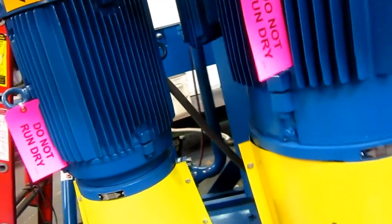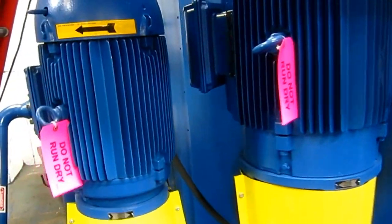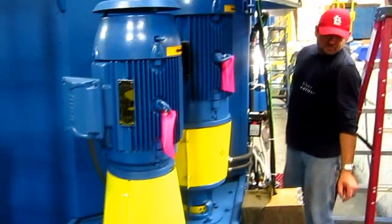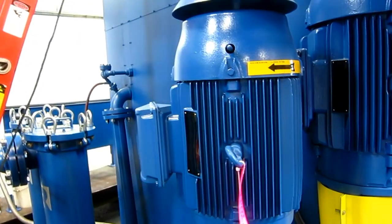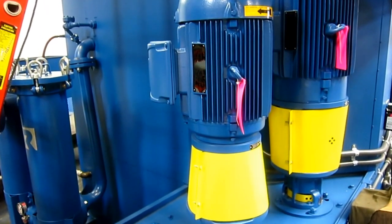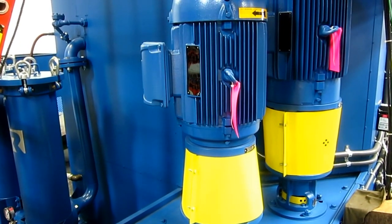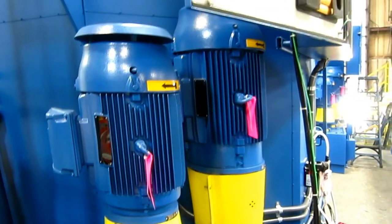There's the duplex pumping system. A small suction pump feeds a high-speed, high-pressure pump. It allows us to handle very hot water without cavitation, because the slow-speed pump has large flow passages and operates at slow speed. It can feed water that is only a few degrees below boiling into the main pump.